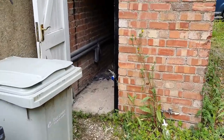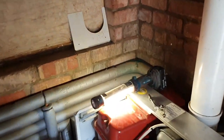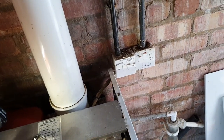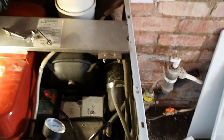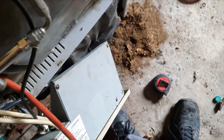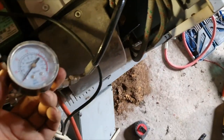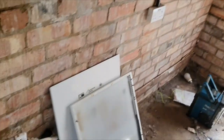That's the crux of it - I can't go any further now because I've got no fuel. The boiler's all ready to go and the heating system is filled up. I'll leave it switched off and come back when we've got some oil. Quick tip: the first thing you always want to do when you've got an oil boiler going to lockout is put your pump pressure gauge on. Make sure you've got pump pressure - if you haven't got any pump pressure it's going to be the oil pump or no oil. I cracked that valve down there and there's nothing coming out of it, so I would say it's definitely a supply issue.